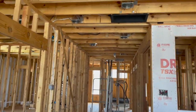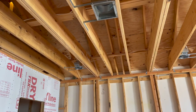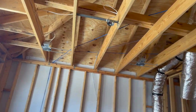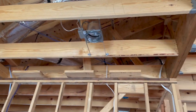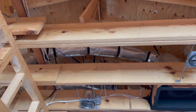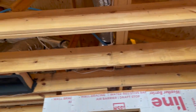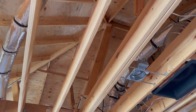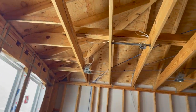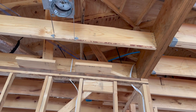Walking up here, if you look at the attic space, the ridge vent is blocked off and there are no soffit vents on the structure. This is a reputable builder that we work with often, and they always foam in the attic space. So just keep in mind — you don't want to write up something saying there's no ventilation in the attic when you know they're going to foam it. You can actually feel the heat just standing up here. Just make sure you have an idea of how they're going to insulate the attic before you write it up.